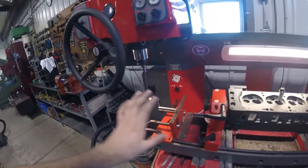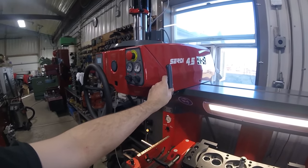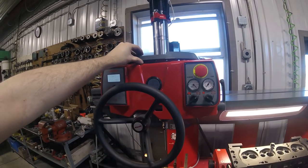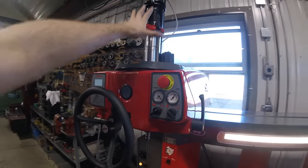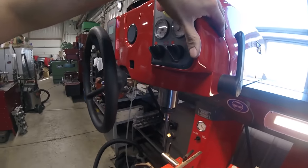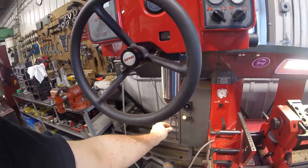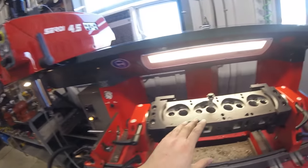The cool thing about this machine is it has three different methods for centering. First, when I hit the foot pedal the entire head floats, which is how we start to get centered on our guide. The second floating mechanism is a planar float that floats just the motor and the spindle to get even closer to center - it finds the true center of the valve guide while floating less weight. The third centering feature is a spherical float - once the tool is down in the guide we turn both floats on and it finds the true axis of the valve guide, giving us a perfectly concentric seat to the guide.